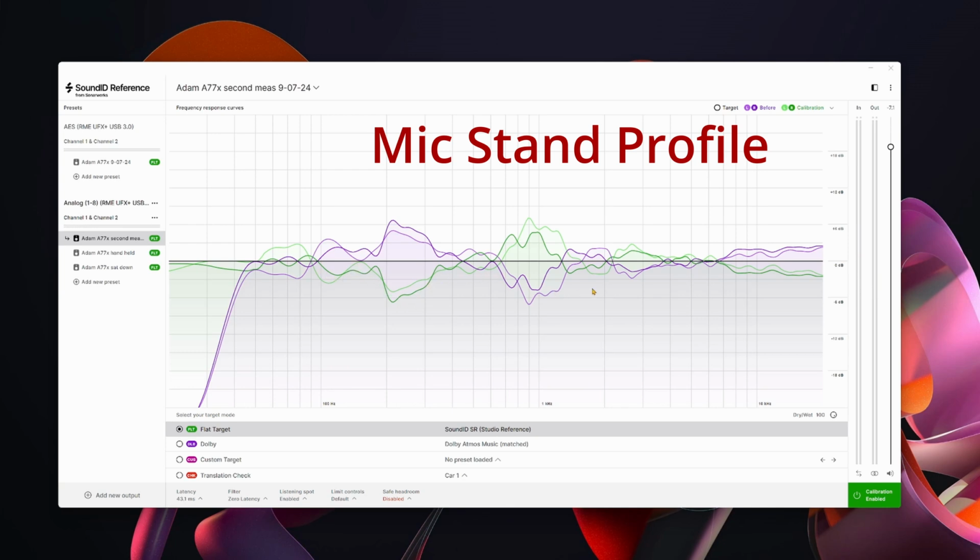Of course, if you've got a 6 dB gain at, say, 100 Hz, and you then think, oh, we need a bit more in the bottom end and apply another 2 or 3 dB, in reality, you're adding 9 dB to a flat signal.